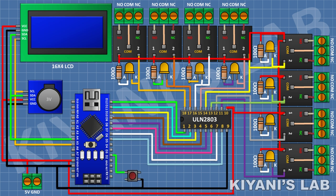After that, I'm going to connect a push button with one pin to D2 of Arduino and the other pin to ground. Then connect another push button with one pin to D3 of Arduino and the other pin to ground. Then connect another push button with one pin to D4 of Arduino and the other pin to ground. We have now completed all the connections. Let's upload the code to Arduino and test the project.